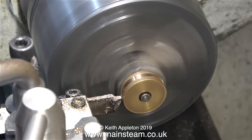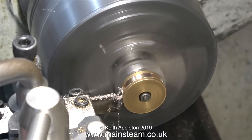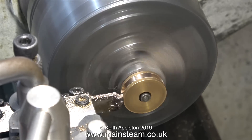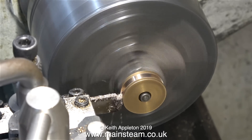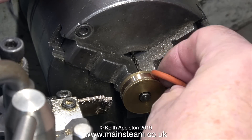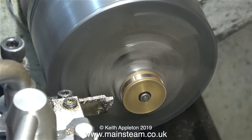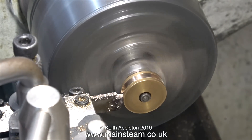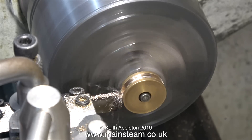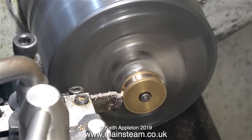There are three ways to do this job. One: make a complete new piston, and maybe a piston rod assembly. Two: machine it using a parting tool, as I'm showing on screen, and do it totally by feel, periodically checking the fit of the piston ring in the piston groove. And three — the proper way: make a new piston and rod and machine the groove according to the specification sheets for o-ring clearances in pistons in cylinders.